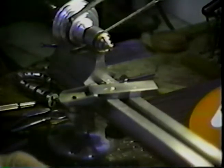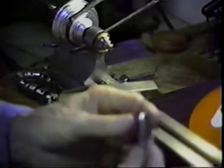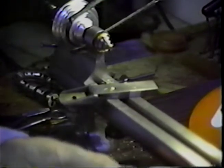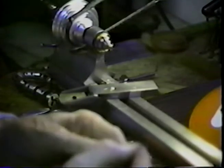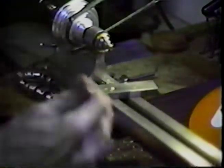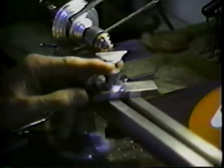With this drill we'll drill by hand with a pin vise. If I were working in a lathe with a tailstock chuck, I would simply put the bit in the tailstock chuck. Here, we place the bit in a pin vise. I have to start the bit — I want the hole to be perfectly true, not going through at an angle. When I thread it, I want it true so that it will screw down firmly against the hand. So I must catch a center to start my drill — use a fine-pointed graver.